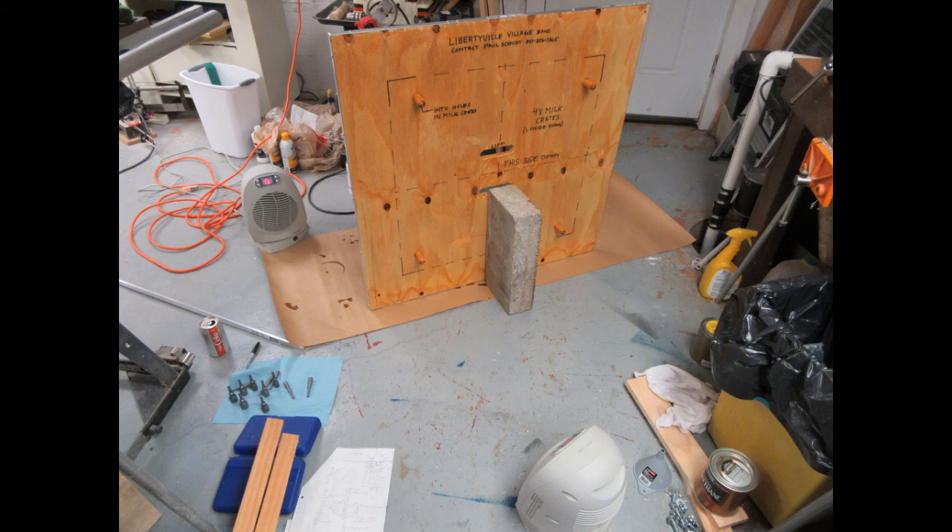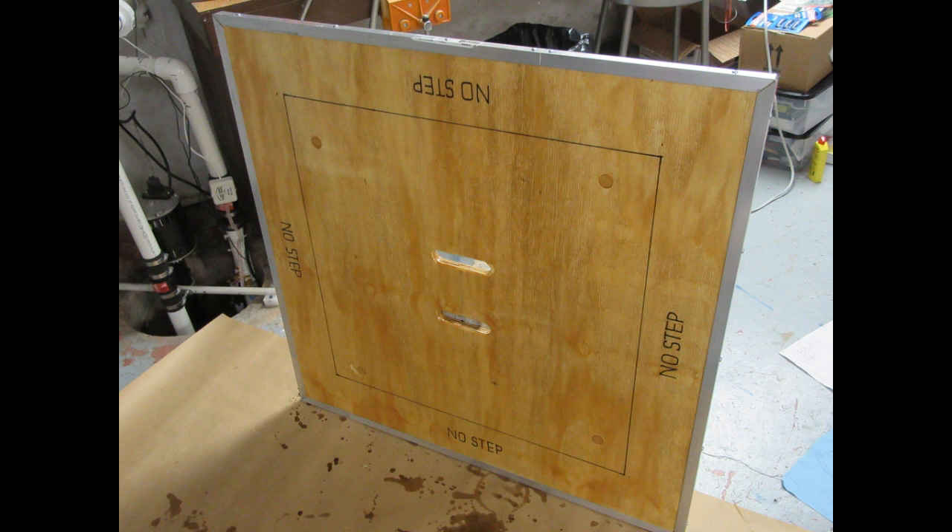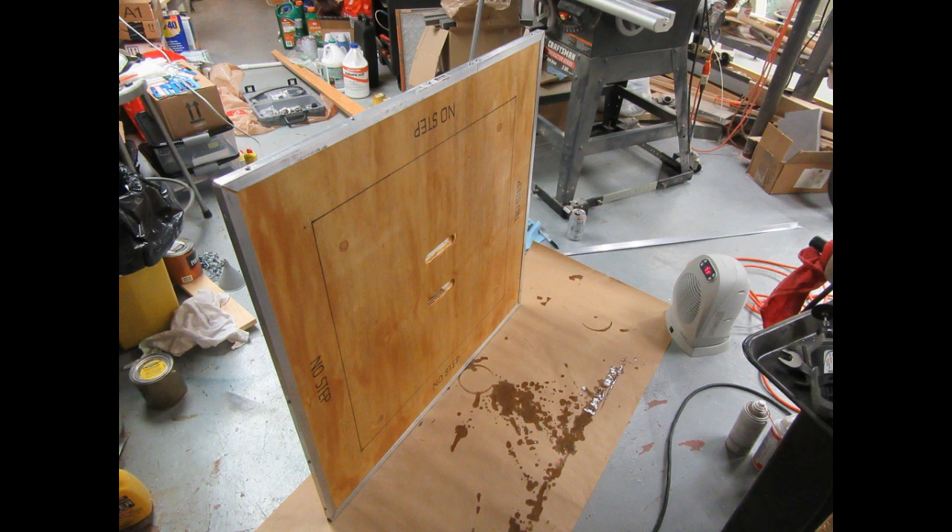Finally, since I wasn't going to use carpeting on the top side, I put a nice heavy coat of varnish on the top and a single thick layer on the bottom just to protect the wood. This podium is always going to be used outdoors, and I was concerned that carpeting or a similar surface would absorb water. With a heavy varnish coating the wood would be better protected and there wouldn't be any issue of water-absorbing or dirt-collecting carpeting. These pictures show the varnishing — as usual in my basement I've got a couple of oscillating heater fans keeping it warm so it cures quickly.